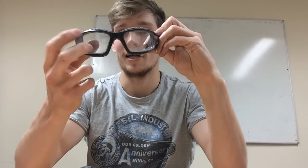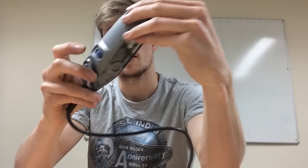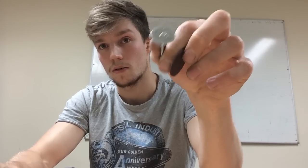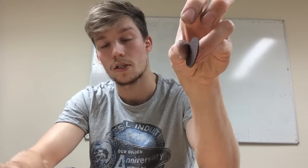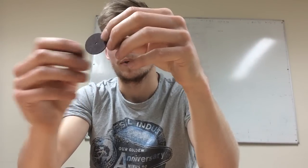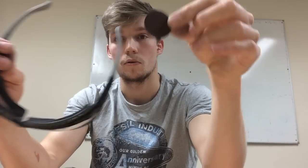If you're cutting hard materials with something like this, make sure you wear safety goggles with polycarbonate lenses, because if this fails and a piece of metal goes flying at 24,000 rpm it can cause a lot of damage. The set itself comes with aluminium oxide discs which are great but they don't last as long as the diamond cutters, and they are really brittle — they snap off quite easily, especially when they get hot. I would definitely wear proper safety glasses when using these discs at high speed.